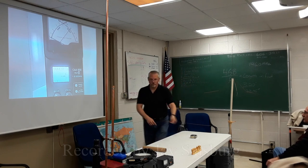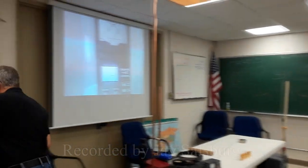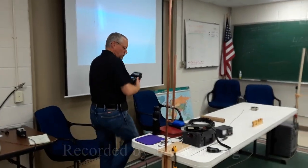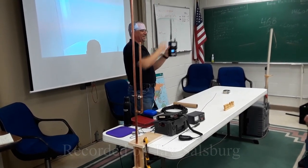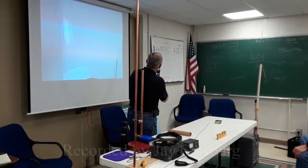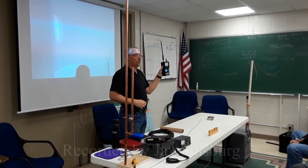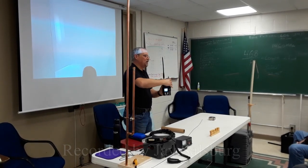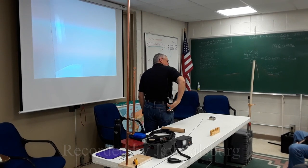All right. I have another demonstration. I did this just for the hell of it. Here's my handy talkie. Okay. Let's find where that is resonant. 145.9. So that's pretty good. Now I'm going to clip it onto my belt, and I'm going to hang it on me. What happens to my SWR?